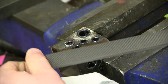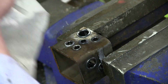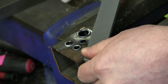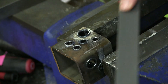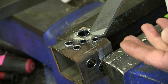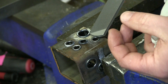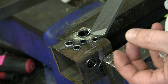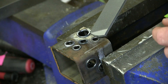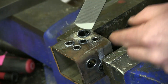Now let's see if that's any harder than the rest. Here's a regular hole — a nice sharp file bites right in. Here's the half inch — bites right in. Here's the carburized, case-hardened carbon hole. Soft, soft, soft. It's one thing to think about it and know it's not going to work; it's another thing to try it and see that it doesn't work. It doesn't work because there's not enough soak time. It takes a long time for carbon to dissolve into steel — hours in a heat treat oven — to get even a few thou of case hardening. So it makes sense that you could use graphite as a lubricant with no trouble at all.